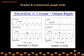When using the ceramic capacitor, the second waveform is a sinusoid with some ripple, which can be minimized later. This is because the ceramic capacitor has a resonant frequency up to 1 megahertz, hence it works well at this frequency.